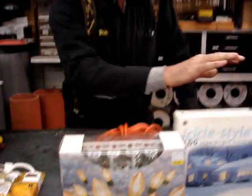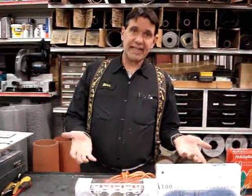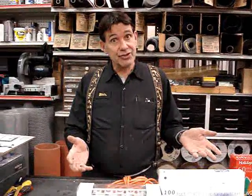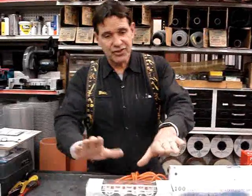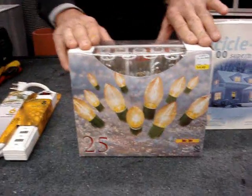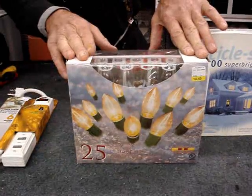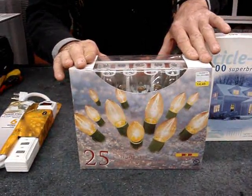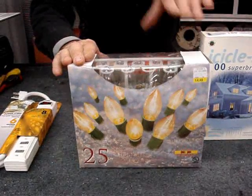When we're plugging a bunch of stuff together, we can add up watts or we can add up amps. Volts times amps equals watts, so we can talk about all our power as watts or as amps. I took this 175 watts, divided it by 115 volts, and that gives me approximately one and a half amps.